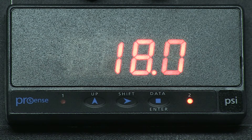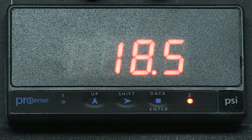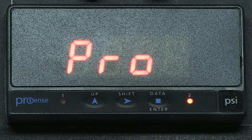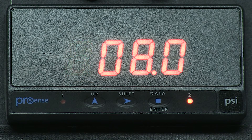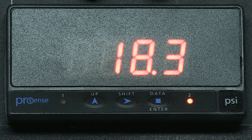This is how you set up the relays in the ProSense digital panel meters. They all pretty much set up the same in the DPM1, DPM2, and DPM3 meters that have relay outputs. If you look at the manual for the DPM2 models, you will notice there is a way to access setpoints without entering the program mode. If I press Enter, then the up arrow key, it takes us directly to setpoint 1 and setpoint 2 values. We can make changes and then save these values — this allows for easy adjustments to our setpoint values. I hope you found this video useful, and follow us to our other how-to videos on the ProSense digital panel meters. Thanks and have a great day!